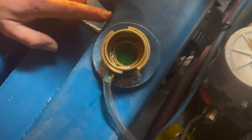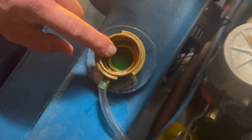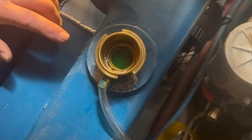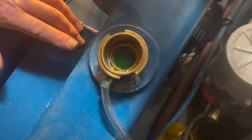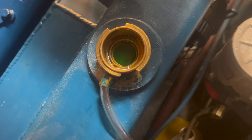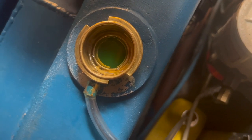All right, so we've got both sides of the heat exchanger tubes blocked off, and one side's going to pump air in. If air bubbles come there, it's where it's clamped on or it's in the heat exchanger tube. If this gets bubbles, it'll be an easy fix. I hope we see bubbles. And I hear it leaking over here on the cork side.